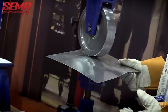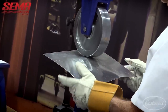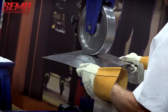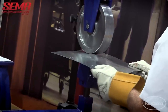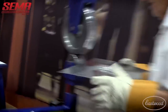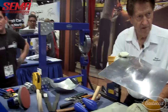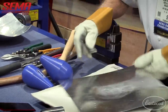Now, if you have never used a wheel — what I'm doing at the end of each stroke is I turn it very slightly. That allows me to walk back and forth across the panel. I do it automatically without thinking. Now I've got the walnuts out of it — you can see it's pretty smooth — but I want more shape, so I'm going to pound it again.